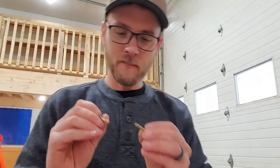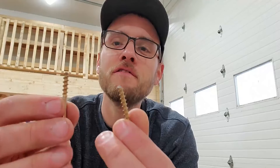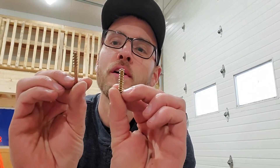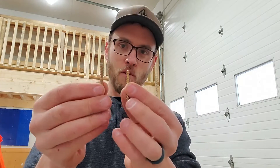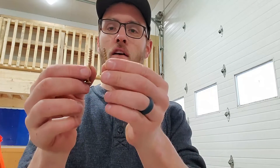If you were the little piggy in your house and somebody huffed and they puffed, they would have blown all your screws down. That did not take a lot of force — just a mild tap. These yellow construction screws are simply meant for holding things together. They are not meant to have a stress load put on them, because in the event that the load becomes too great — which is a lot less than you think — off they shear.